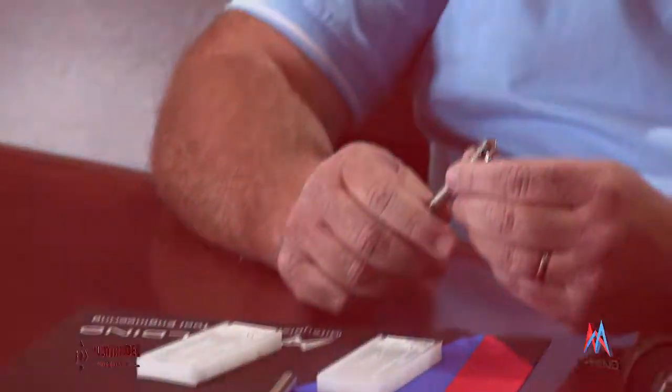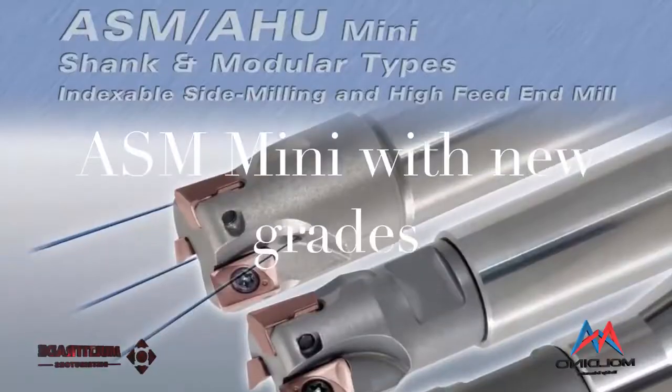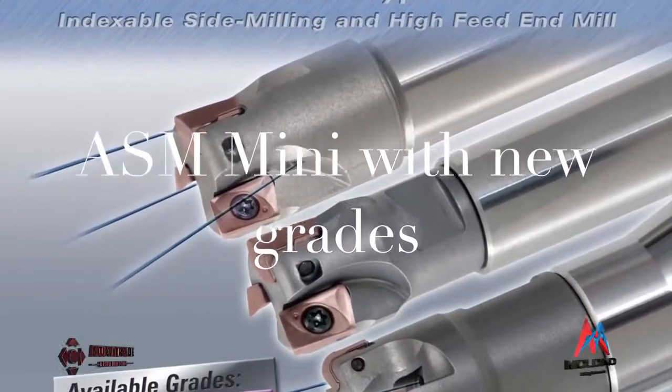And then we have the ASM 2-corner insert. The ASM is another range of cutters that we've introduced to the South African market under the Moldino branding. It's a very universal cutter. It begins in a straight shank type from a diameter 8 right the way through to a 21 with your cylindrical shank, and in your modular system it goes from an 8 up to a 32mm cutter.